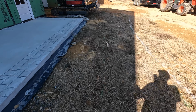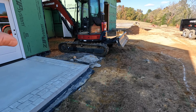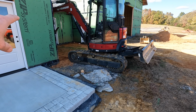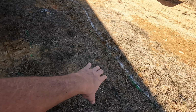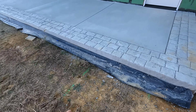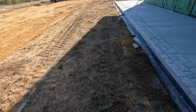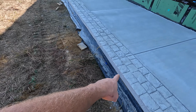But the one thing about this breezeway that I've thought through is, obviously that's a pocket for water to sit. And I've got the same thing on the other side. But I'm gonna have concrete here and a pool here, in which they want that water to drain away. But obviously I've got my porch here. So there'll be a little sidewalk come out here and catch this 4 foot, essentially sidewalk around this side of it. But they will pitch the concrete back in which I've got my porch.